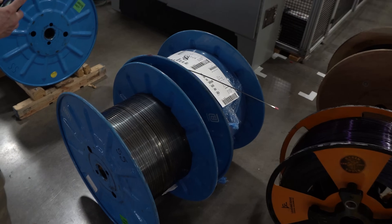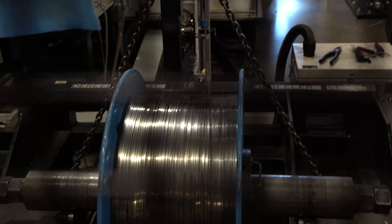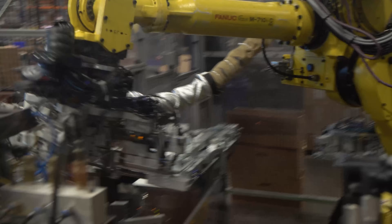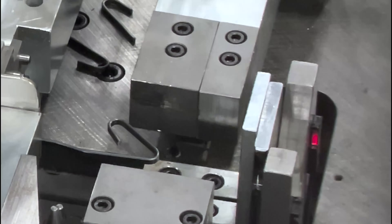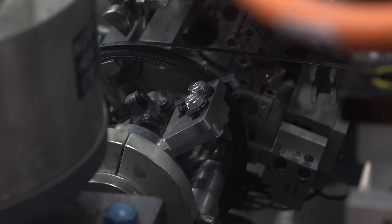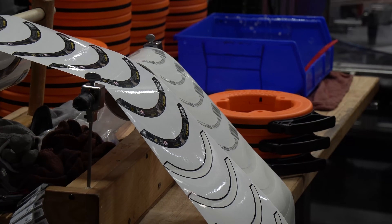We walk up and there's a huge reel — just like a big wire reel — of this flat tape. It already comes flat like this, and they feed it into a machine that rolls up the tape to a certain measured amount, then it's cut. It then comes over to a section of the assembly line that bends the tip, so you always see Klein's tips have this kind of special bend in them. Once they've got that tip bent, they bring it over to where the cases are, put the reel inside the case, close the case, and send it down for humans to add all the stickers and make sure it's snapped together and finished.